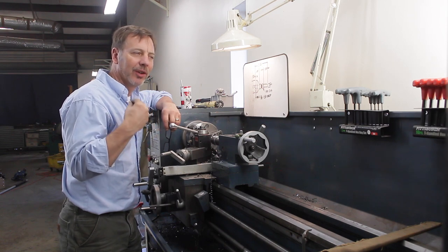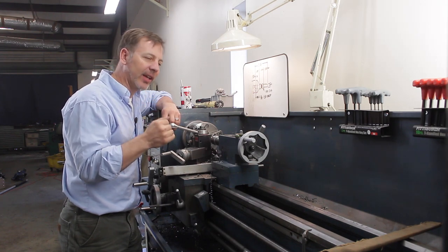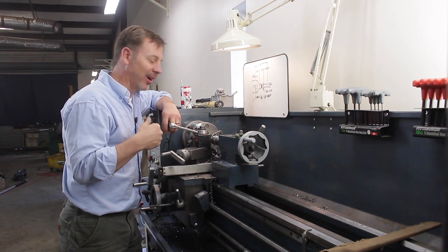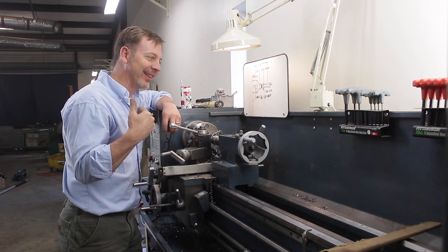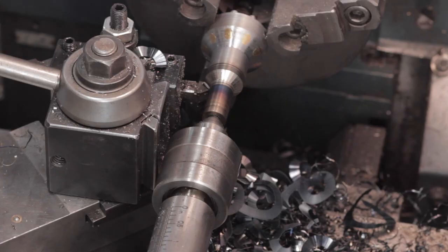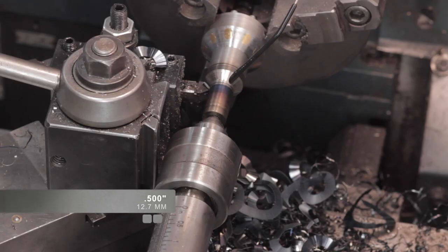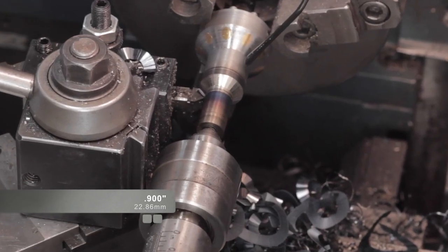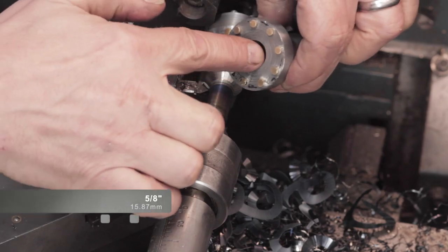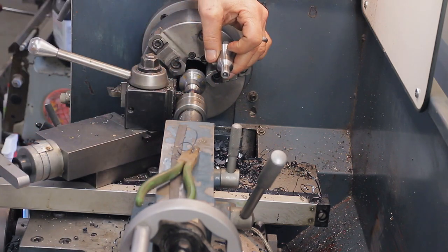Really when you're talking feeds and speeds, in my opinion it's more about CNC operators getting their machines pushed to their limit to where they are effective. For manual guys like me, it's about what can you get away with for that one part. Tool life isn't as important to me as it is for a CNC operator. So we've got this basically down to size. This diameter here is almost half inch and that's what the drill chuck is going to clamp onto. This here is .900, so it's almost one inch. We have to remember there's a 5/8 inch hole that goes through here an inch and a half, so we want to leave enough wall thickness to make sure there's enough structure.